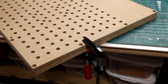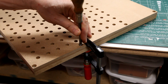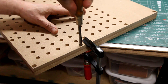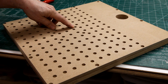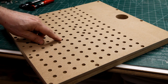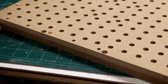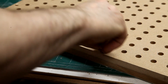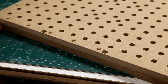With the two components now complete, I place the top component on top of the bottom component and secure with some number-eight, half-inch wood screws. I do recommend using a small clamp to firmly hold the two components together while securing them. There are also four mounting holes in the center of the fixture. The quarter-inch by half-inch long dowels are then added to form a fence so I can quickly align my stock.